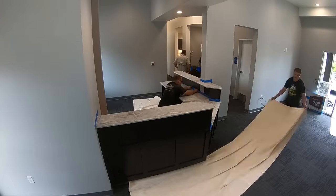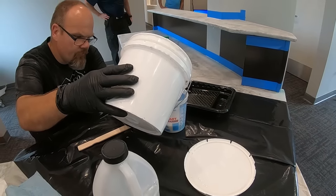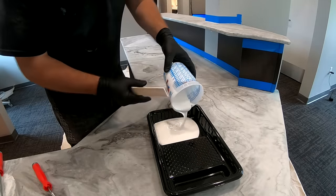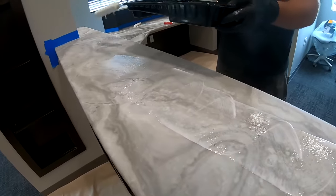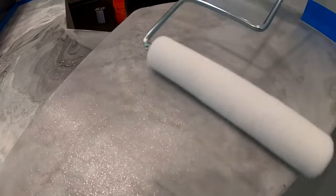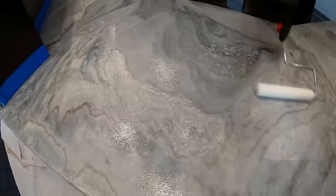Another one of my sons came on cleanup day. We removed all of our masking, laid out some canvases, sanded, wiped the dust, and we're ready to mix the ultimate top coat — this is going to give it that beautiful natural shine. We sanded with 220 grit to get a great mechanical bond. This is again a two-to-one ratio — a little goes a long way — mixed with a paint stick. We de-lint our roller by rolling it on masking tape, pour it into a paint tray, and use a quarter-inch nap roller. We roll it on somewhat heavy in the middle, then feather it out to the edges. I have a second, brand new dry roller ready so that immediately after rolling it on heavy, I dry roll the surface. This feathers out any lap lines, removes excess material, and allows you to get a very tight finish — it looks like you sprayed it on professionally.